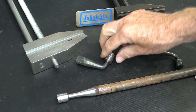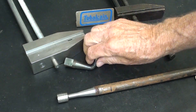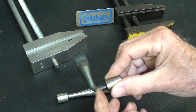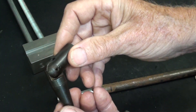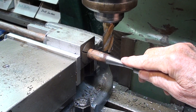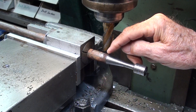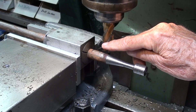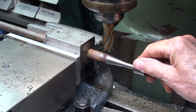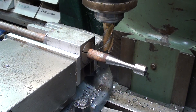The next thing I need to do before I make the bend — and again, this is the crank handle — before I make the bend, is to mill it down so that it is a quarter inch thick. Then I will round this off and then make the bend. Order of operations is pretty important. It's kind of a tricky little part, really. I'm at the Bridgeport mill, and the workpiece is mounted in a square collet block and a 5/8ths 5C collet. I've got a couple marks on there, but with this 3/4-inch end mill I'm going to mill this down into a flat. Since this is 5/8ths thick, I need to remove 3/16ths from each side. I will mill one side, then rotate it 180 degrees and mill the second side.